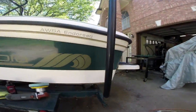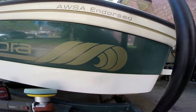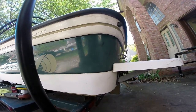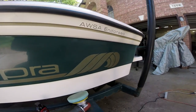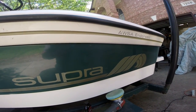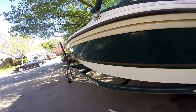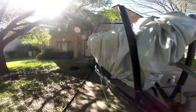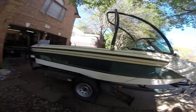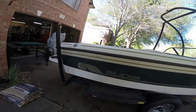Look over here — you're going to see the stark contrast. This is an area we worked over; obviously it's not perfect. This boat is a little too oxidized to bring back to absolute perfection without a lot more work. But here's an area we didn't work on and you can see it looks a hell of a lot worse. If we can get this sort of level of niceness throughout the boat, I'm going to be pretty happy — it's smooth as glass right now. We're going to put a little wax over it, which will help bring a little more luster and help protect it. So this side of the boat is all done — the buff job and the wax. I mean it's not industrial grade, but it's pretty good. This other side I haven't touched yet — you can see it's all oxidized still. Got the back to do, got this other side to do, but not too big of a deal. Just buff it out and wax it.